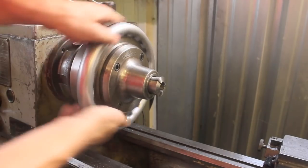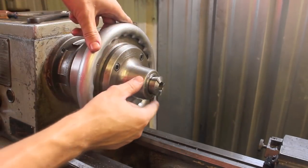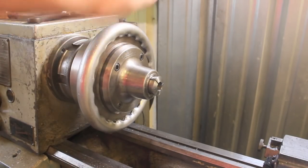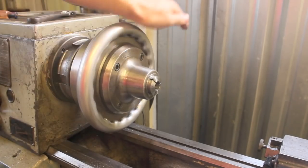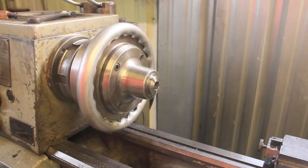And then I guess you crank down on it that way. And then you stick your piece of material, in this case it would be an 11/16 piece of material, in here, and you crank down on it and you get it all nice and tight. And when it's the way you want it, then it holds your material in there kind of like a collet and a collet body in a TIG torch would. It's the same concept. Just like that, you'd be ready to go.